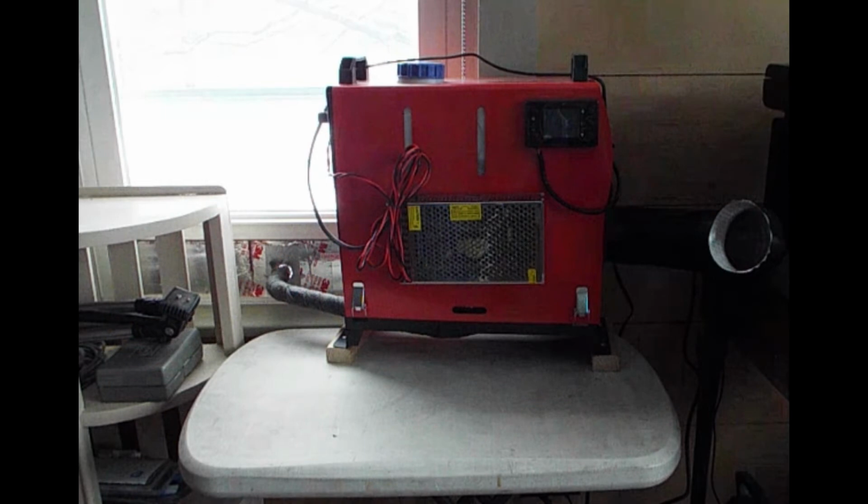Now, when I did that, I noticed that when I first started it up, for the first 3 minutes as it was warming up, I could smell diesel. And I thought I had an exhaust leak, but I did not. I probably had it from day one, but when I had it in the outbuildings, I never smelled it because all those old buildings leak like sieves.